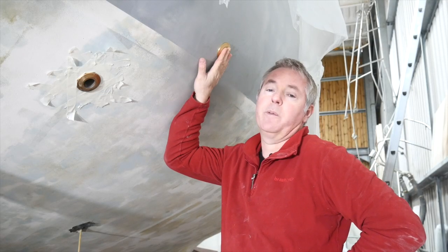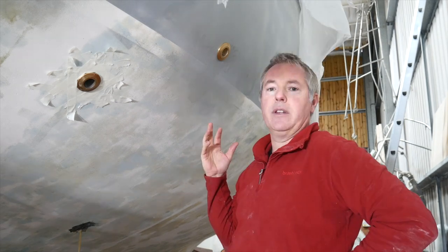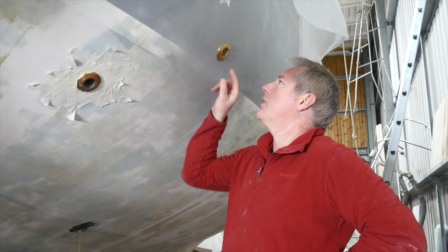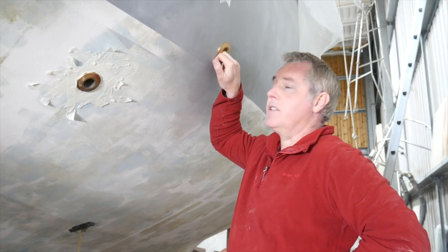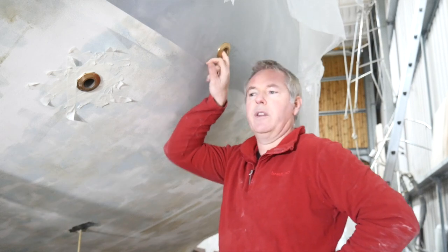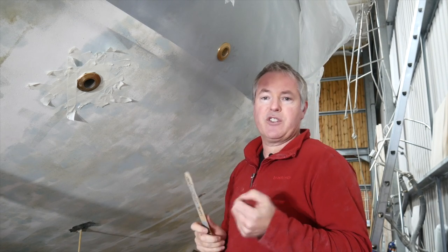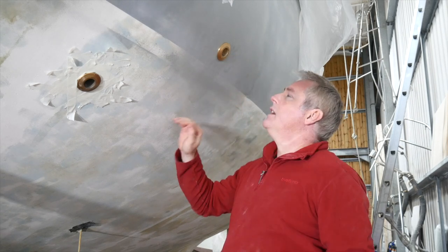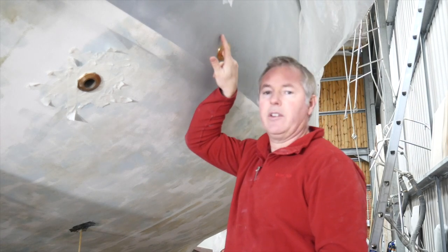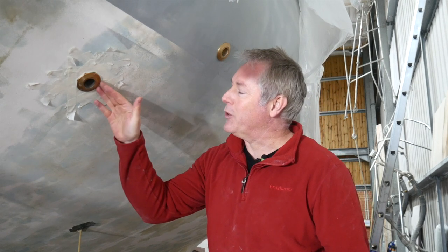Well I'm not having a lot of luck with these through-hole fittings. With this one I tried to align the through-hole and couldn't marry it up to the thread inside — the studs were kind of not quite aligned, so the backing plate and the flange were slightly off-center. I had to undo those studs and reposition it. I think there could be a slight problem with the first template I made, whereby the three studs don't ensure the backing plate is perfectly aligned with the hole. Since I broke my strap wrench, I've just used a mixing stick of the right diameter to catch the lugs.